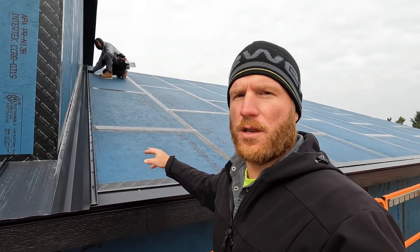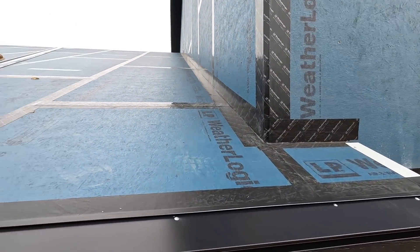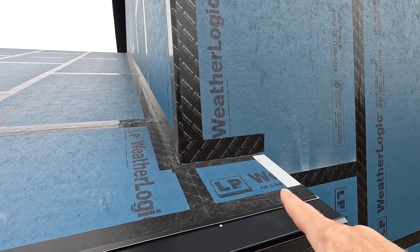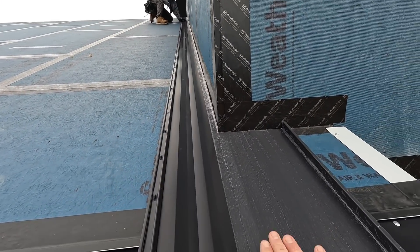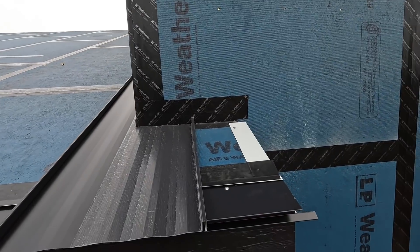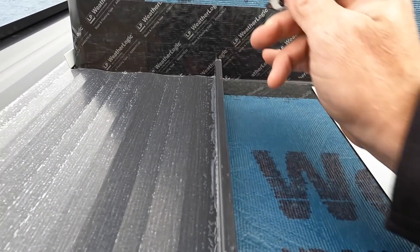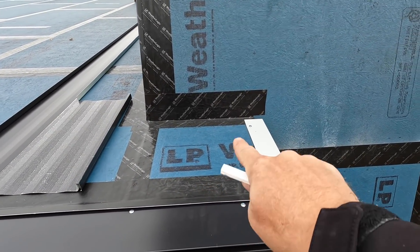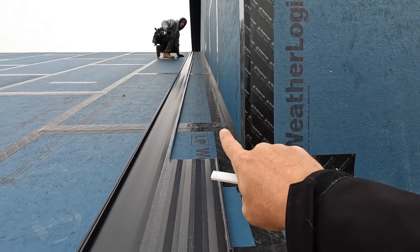We got the other side on. Now we're going to go ahead and set this side in — we did the exact same rip up this wall, once again leaving the first piece off. Greg, let's go ahead and slide this in. The important part is just making sure I've got a little tiny gap there. Looks good up the wall. I'm going to mark right where this edge is — nine inches. Now that we've used this piece to get those marks, I'll make this panel up, install it, then finish this one and run all these trims up the wall.